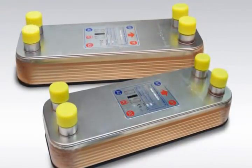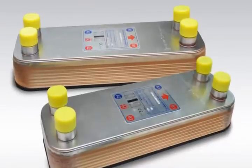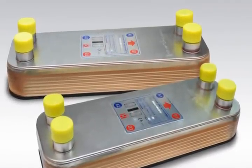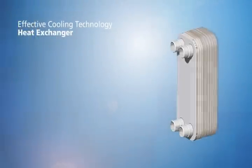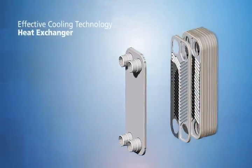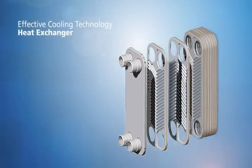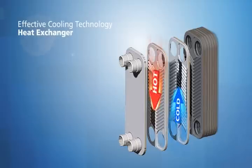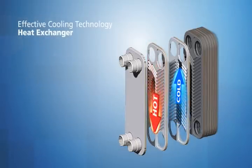A highly efficient, corrosion and pressure resistant heat exchanger is used. It consists of chevron plates of acid-resistant stainless steel. Every other plate is reversed so the ridges of the herringbone pattern intersect one another on adjacent plates, forming a lattice at contact points. The lattice structure causes vigorous turbulence, thus ensuring maximum heat transfer.